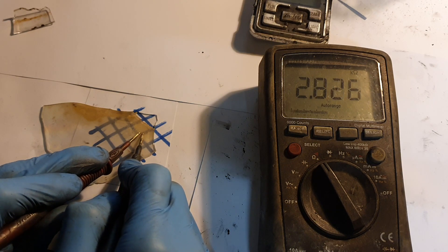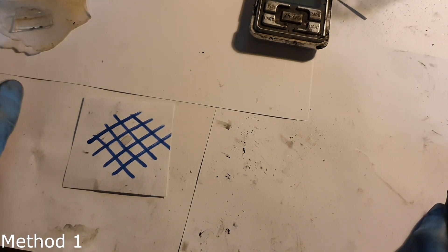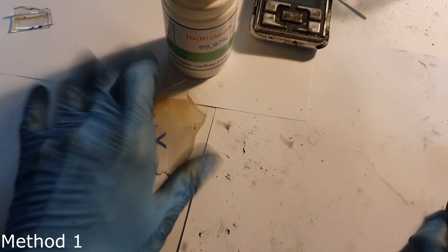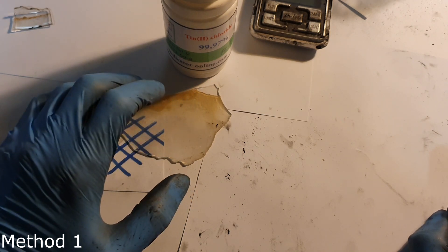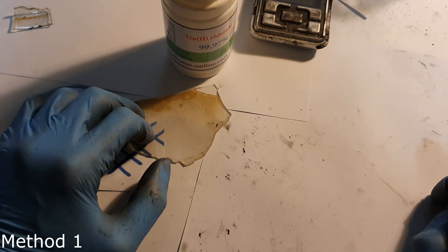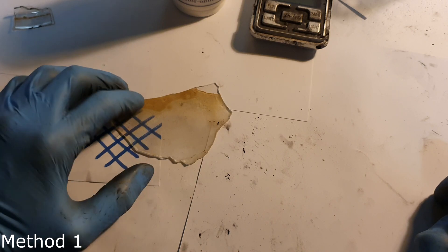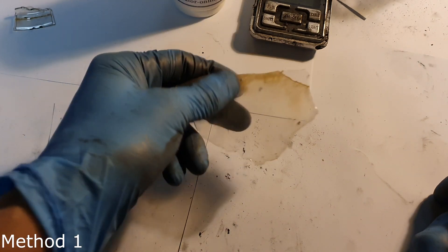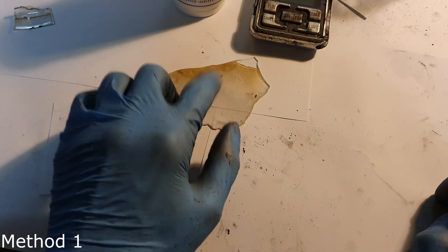2.6 to 2.5 — really nice. So the basic material I use is tin chloride. I put the tin chloride on the glass and the glass is placed on a hot plate. The hot plate needs to be around 350 to 400 degrees C. The tin chloride will convert into tin oxide and you get the glass covered with tin oxide, which is both conductive and transparent. But more tin oxide means the glass becomes cloudier.